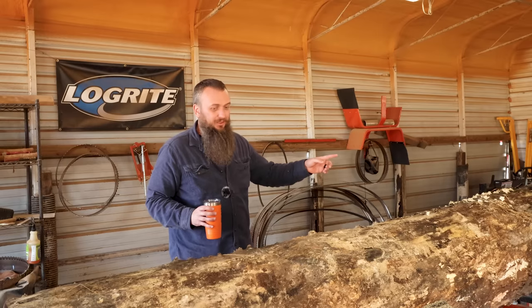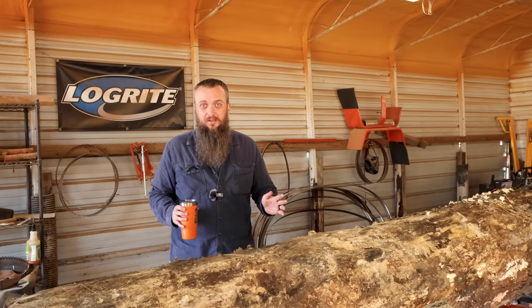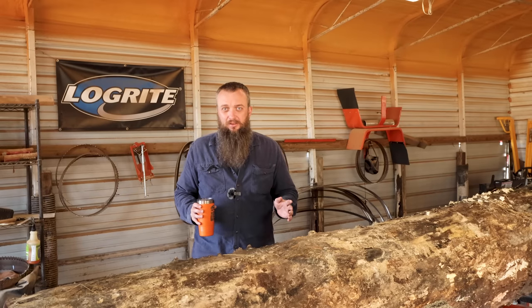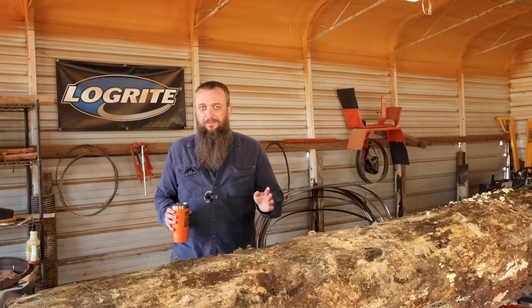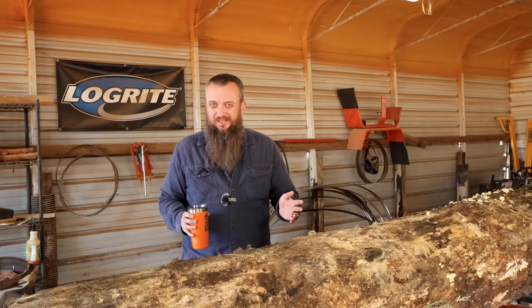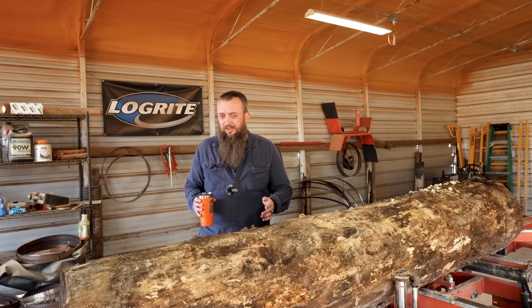And guys, judging by what I'm seeing here, the bark is gone. The outer layer on the end grain, what I'm looking at, it looks like we're going to have a ton of spalting on this log. If it turns out that the spalting is really good, we're going to do 8/4. If I open this log up and I'm wrong about it and the spalting's not really as noticeable, we'll do 5/4 boards. But I think we're going to be in good shape.